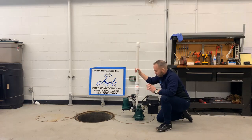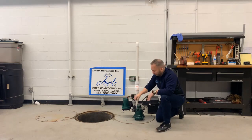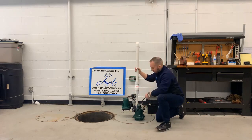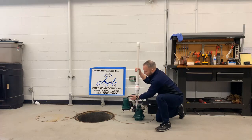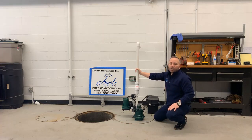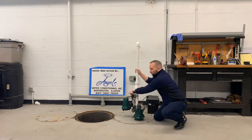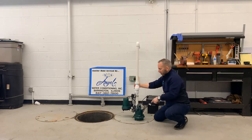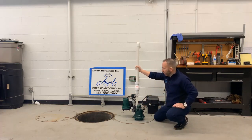This is a DC pump so it's a bit cheaper. Some battery backup systems actually have a full secondary pump positioned a little higher in the pit, so if the water rises higher we know the primary pump has failed and the alarm goes off. If you have power outages lasting a day or two — as we see in Barrington when trees fall in big storms — and you don't want a full battery system, we recommend getting two pumps: the primary and a second one on your generator as backup.